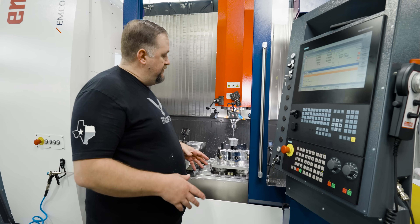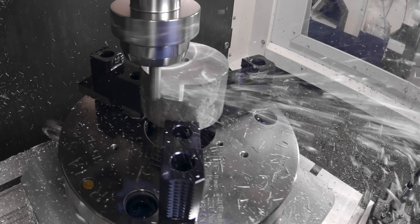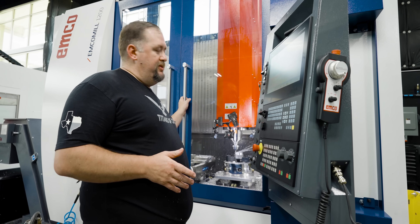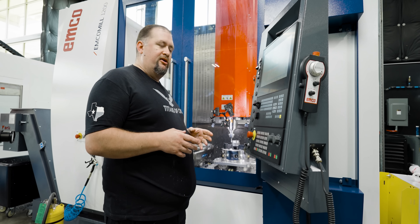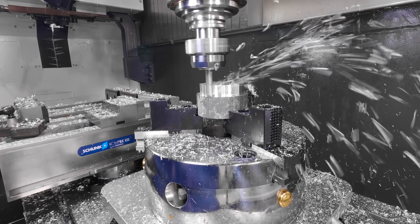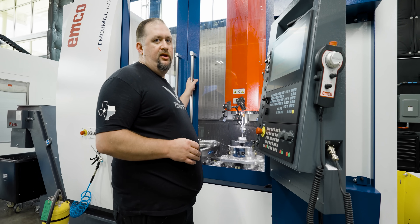In between each operation, since we don't have coolant washing away our chips, I'm going to blow the chips off the part and away from the chuck and table. Now a lot of you may be thinking you'll just use the coolant already in your machine. The problem is, if you're using a water-based coolant, the chips soaking in it are going to be oxidizing and releasing hydrogen into your machine. If you've ever seen the Hindenburg videos, you'll know why hydrogen in enclosed spaces is a really bad idea when you're risking starting a fire. Another reason you don't want water-based coolant is it will almost instantly start corroding your part.